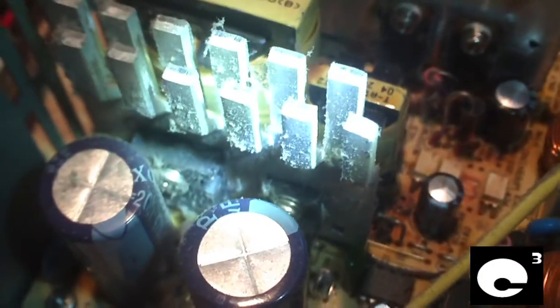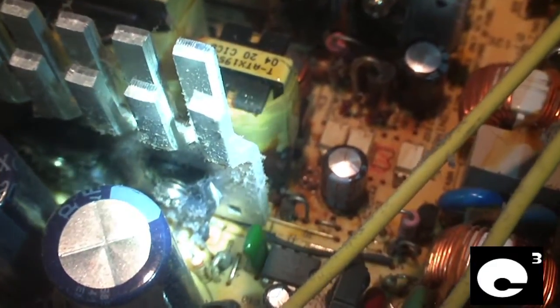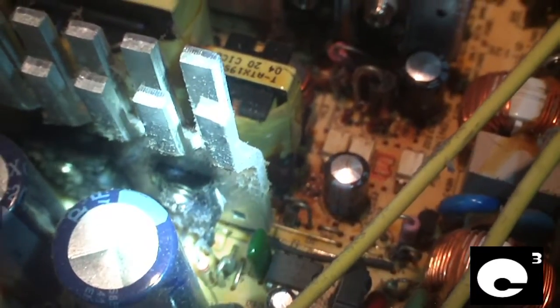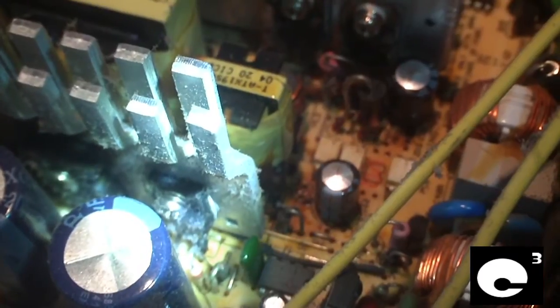The next clue to showing that this is a 2-transistor design: if you look here on the primary heat sink, there's a big switcher to the left and a little bitty switching transistor to the right — that's for the 5-volt standby rail. You'll notice that part is missing from the 12Z model, as I'll show you in a moment.